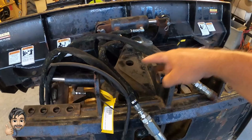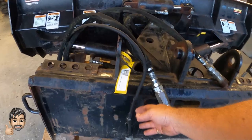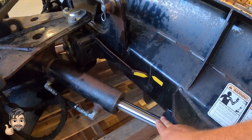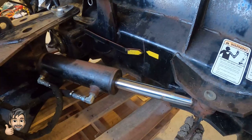The tilt and angle blades need to function with a little solenoid on the bottom, controlled through this 14-pin connector, and we definitely have some problems there. I've sprayed everything down with chain lube to try to loosen things up because the rams have rust on them. The ball knuckles on the very end are all rusted and were basically solid, so we're going to put some fluid on them and try to lube them up as well.